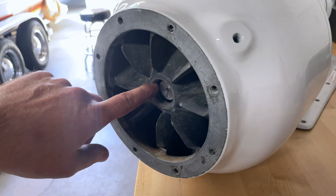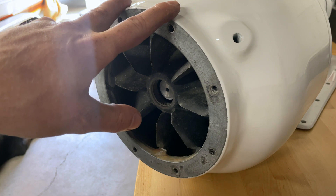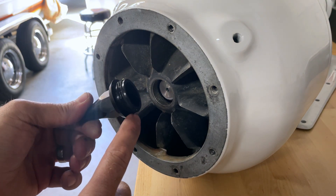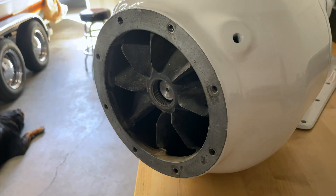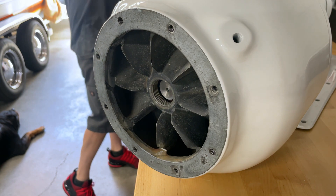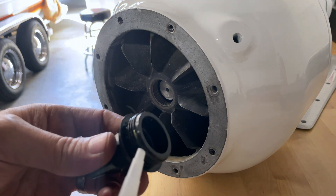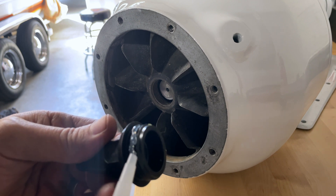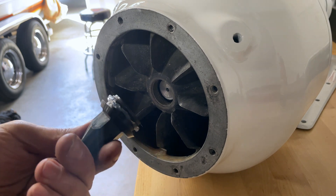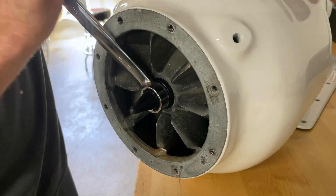Since this is a Berkeley Bowl and we have oil in the back here — filled into one of these fill ports, with another fill port on the other side, both spaced evenly at the top — this is full of oil, so we have this end cap that we need to install. We seal this with some silicone and then screw it in. I'll put a light coat around that so the oil doesn't leak out, then spin this in and snug it down.